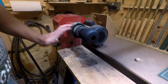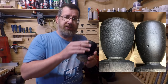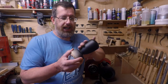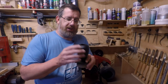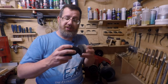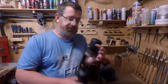I've left both to dry overnight and visually you can see quite a difference. The ebonizing one has a really really pitted effect — it's actually quite nice but not always what you want — whereas the paint has come out a lot smoother, though it also has a slight stippled effect, very much like very light sandpaper. I think both effects are caused by running the lathe while spraying, as my minimum speed is 500 RPM — any slight paint build-up will run with the lathe motion. So I'm going to cut both of these back and hand spray them while manually turning the lathe for a more even coating.